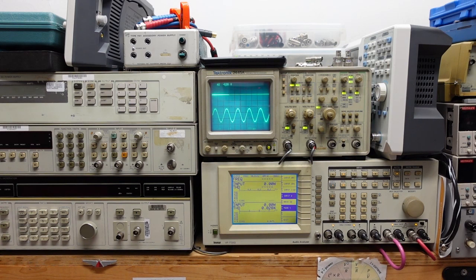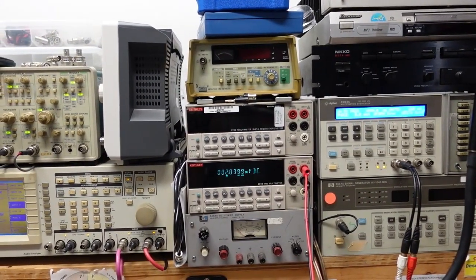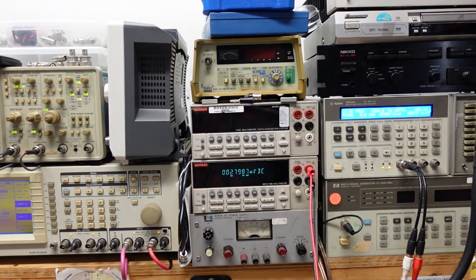I don't want to push it too hard. I think what I'm going to do is make another video on the left channel, but it looks like we got the right channel straightened out — we just need to wait for our parts to come in and continue changing all the outputs. By the way, the bias is supposed to be five to six millivolts, and the meter says we've got about 2.8. I'm going to leave it there until I get the other transistors in. So I'm going to stop this video for now and make a part two. As always, I enjoyed making this video and giving back to the community that has given me so much. Thanks a lot and have a great day.